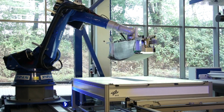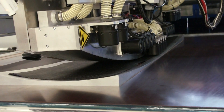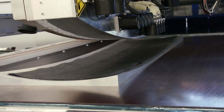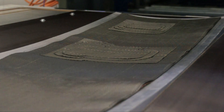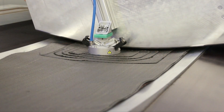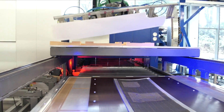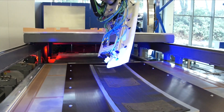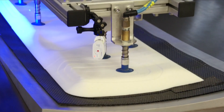The robot transports the correct pre-cut to the layup tool. After finishing the layup of the lower face sheets and the lower reinforcement patches, core integration occurs automatically. The core is placed with high precision exactly in the desired position. This is a clear advantage of rigid and stable foam sandwich cores.